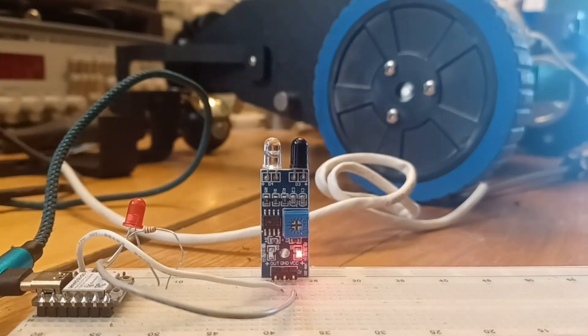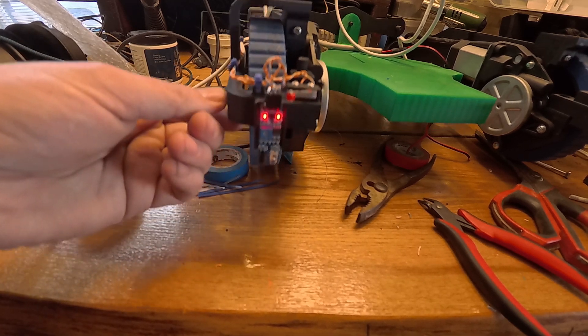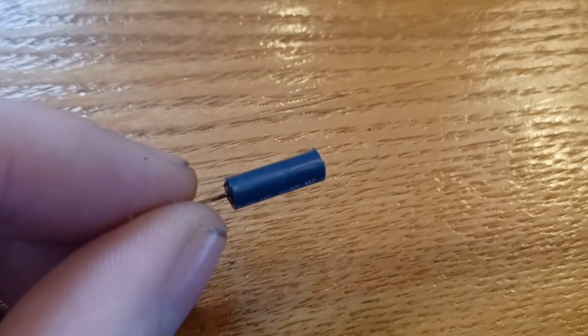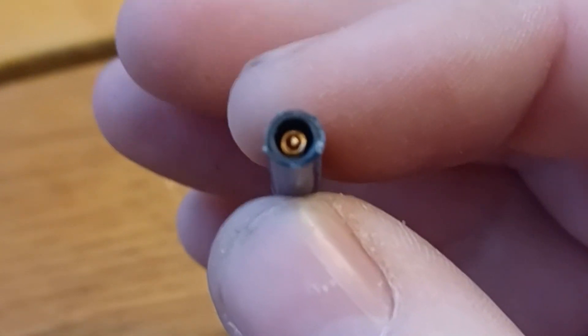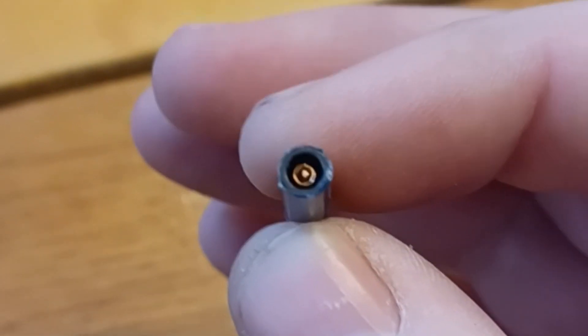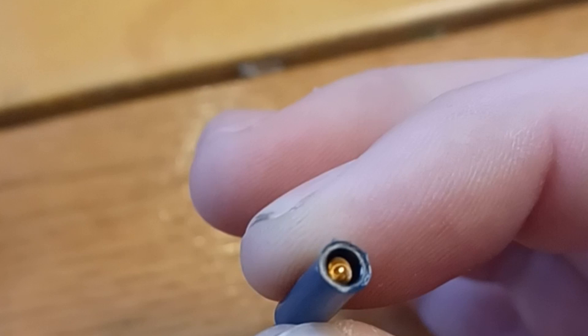Since none of the light is lensed, it's affected far more by distance than by the color of what's below it, which is good. This way the robot will see if there's a drop-off right in front of the wheel — it'll be kind of last minute, but it's still good information. Also attached directly to the fender will be a vibration sensor. It's basically a small post inside with a spring around it, and if it gets hit hard enough, that spring will contact the post. This gives the robot a sense of impact — the bumper will know if it's pushing into something soft, like a pillow, or hitting something hard, like the baseboard of a wall. It's useful data, similar to how humans respond differently when their toe hits a pillow versus the leg of a coffee table.